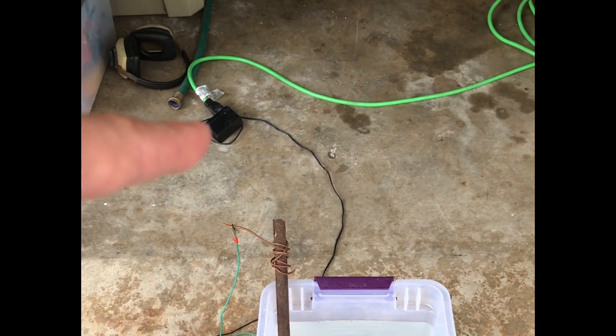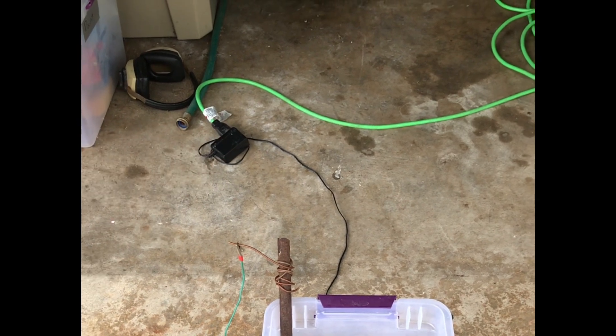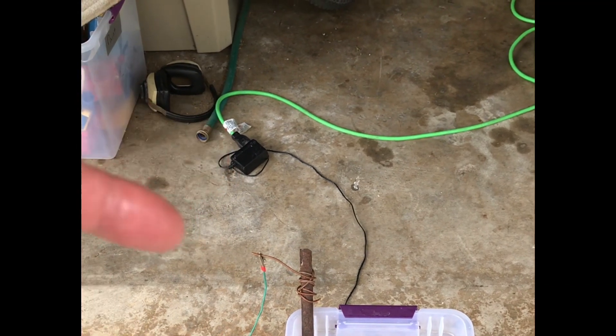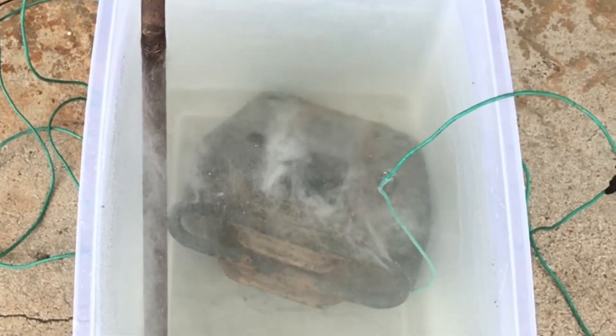Car chargers have got enough sensors to say it's not right and just won't work. So instead I've got a 12-volt power puck. You can read on the back what the output is — that's a 12-volt, 2-amp unit. I cut the lead off and split it so I've got a positive and a negative.